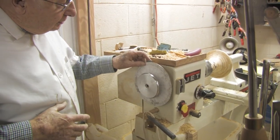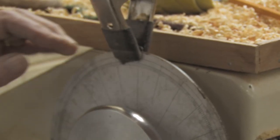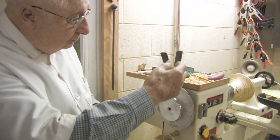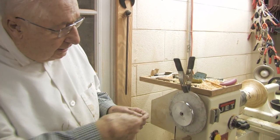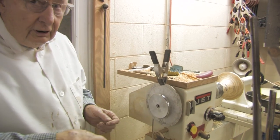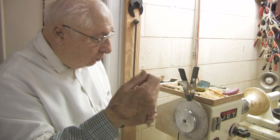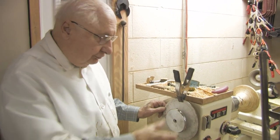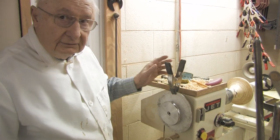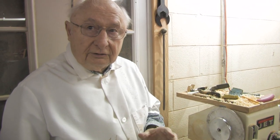In order to use it, you set the indexing wheel to the edge of the gauge and put a clamp on it. Now the lathe cannot turn, and you can go back to your work using the tool rest and the ordinary carving tools and carve V grooves, lines, or gouge flutes in the piece — one at a time — as you move the indexing wheel around to the different divisions, like that. This is a hand operation; the machine is not turning when you do this.